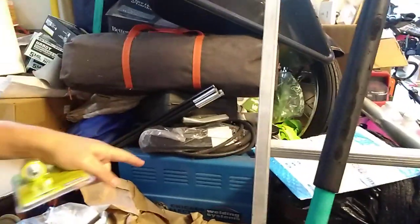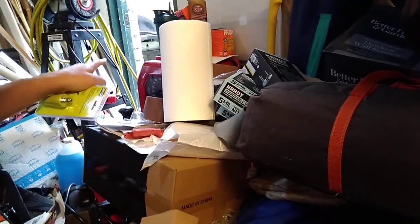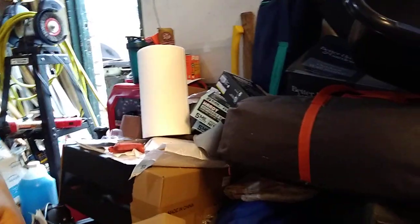But before I attempt, and this is coming up, I'm going to film it. I'm going to attempt to weld that panel back onto the tank, to weld that seam and hope that it's fuel tight. All right? I got to clean some stuff up, but this is actually a MIG welder under here. I also have over here the big stick welder, the arc welder. But the problem is, the big arc welder is going to burn right through that thin sheet metal.